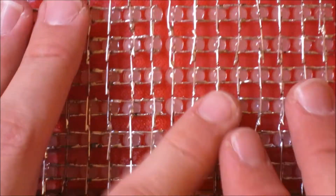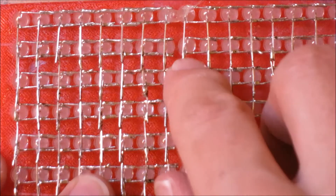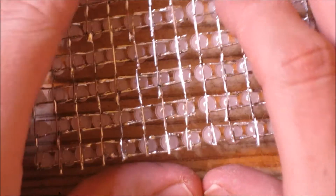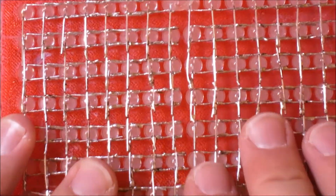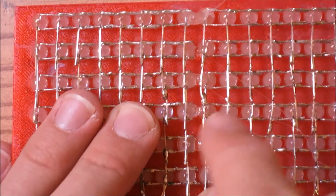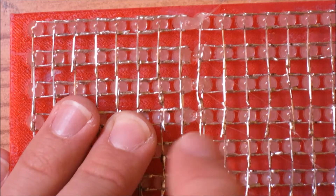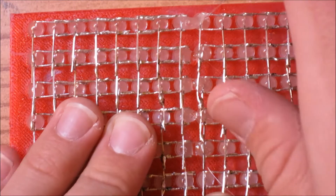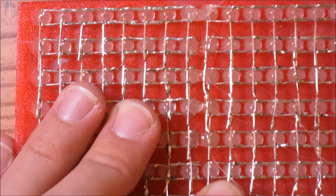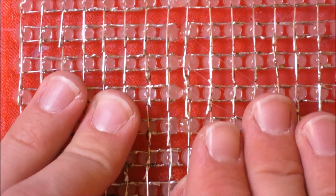Between each gap, go ahead and add some hot glue. You want to add the hot glue when your LEDs are inside the template — you don't want to add them outside because they can separate and drift. You don't want to get too much hot glue so that it seeps down into the template. Add just enough to glue the LEDs together without bridging the gap to the template. Too much glue will give you a lot of problems pulling the matrix out of the template.